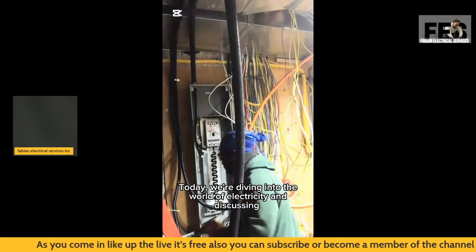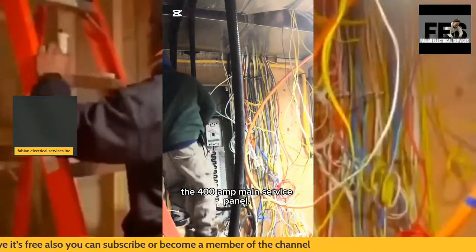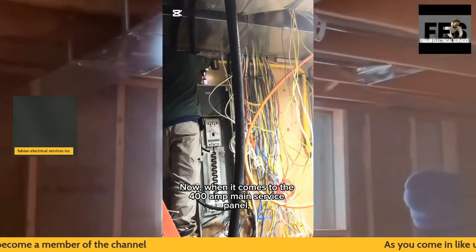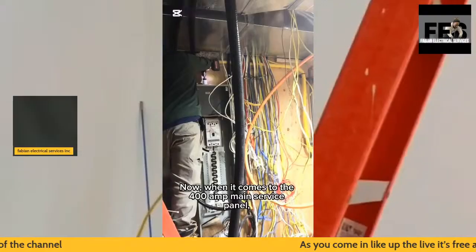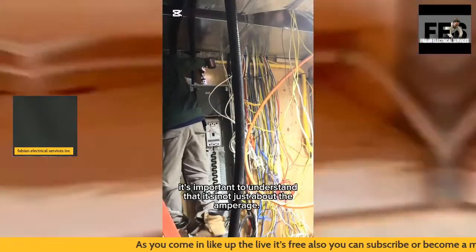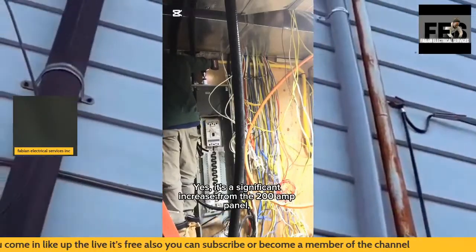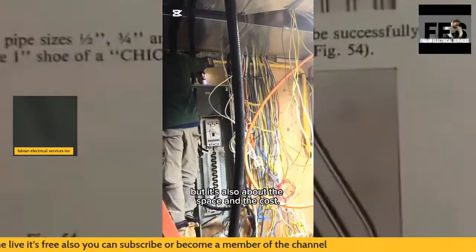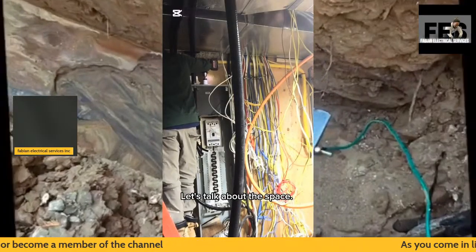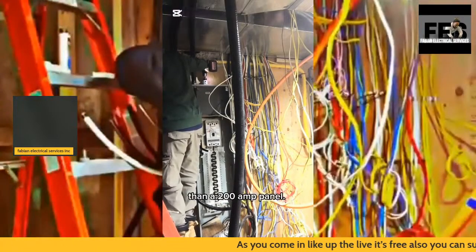What we simply have here is a 400 amp electrical panel, and the installation is going to be the main feeders coming in, which is 400 amp for the 400 amp service. These are 250 kcmil parallel feeds of cables that I'm running. Again, the cables are the same length.